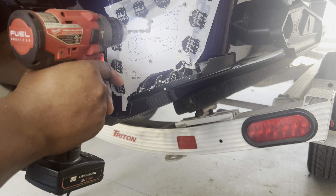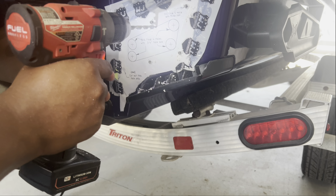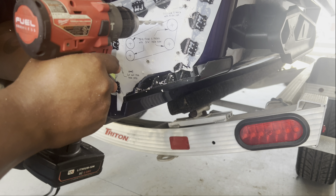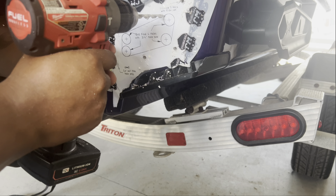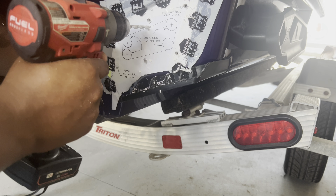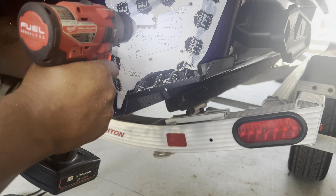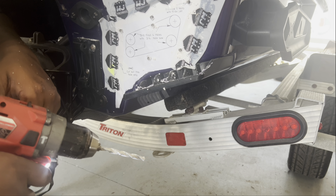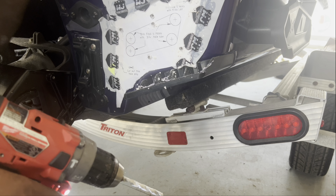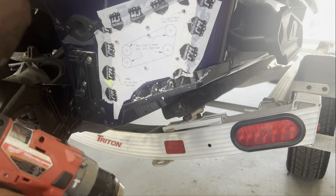I start right here because our cut line — we're going to cut on the line, not inside the line, because you have to cut some more. Cut right on the outside of the line. You get this one shot, but if you're unsure and don't have exact tools you can always cut away a little more, but you can't put a little more back. So make sure you cut on the line. I take my drill and put it right under the hole, start my hole to put the roto zip in there. Do the same thing for the other side — drill all the holes out, cut out one side, and do the same on the other side.